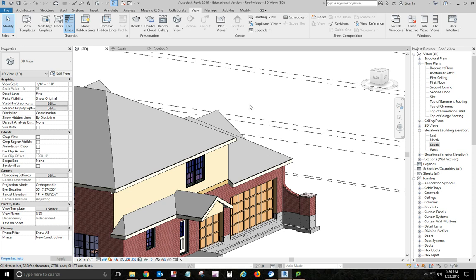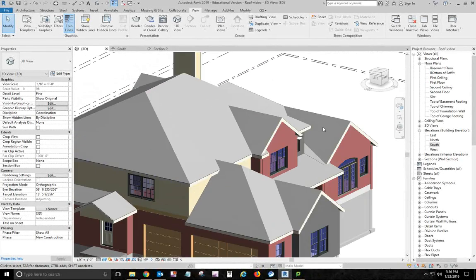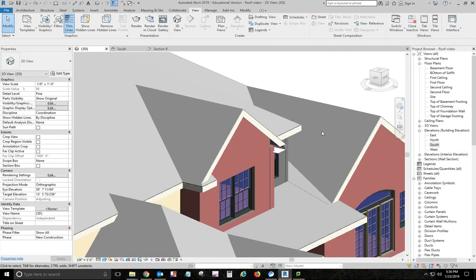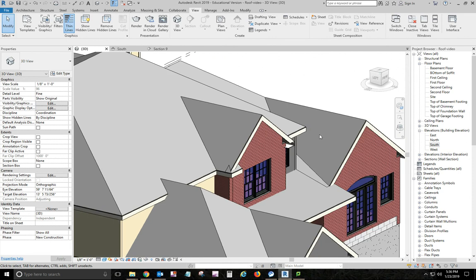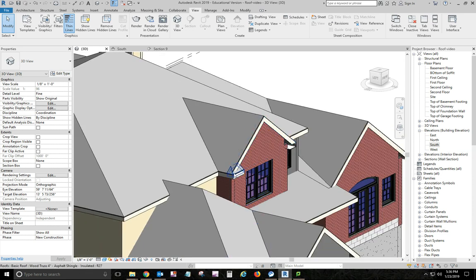You should have your roof done. You can do fascias all the way around the main roof; however, the gables need to be a separate fascia operation. Do all the horizontal joints in one operation, then start over and do the gable fascias in a separate operation — still with the offset — because we're going to get into how to do the returns.